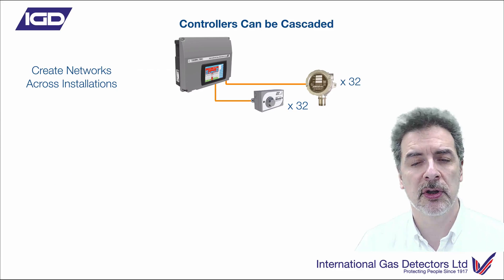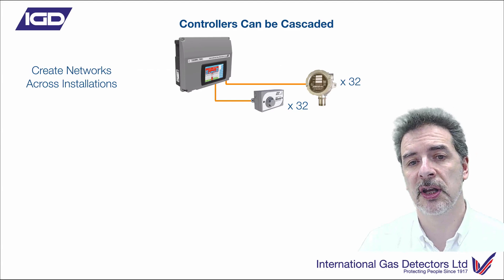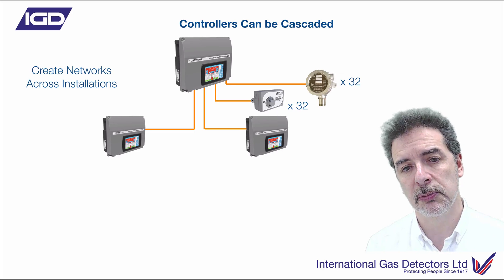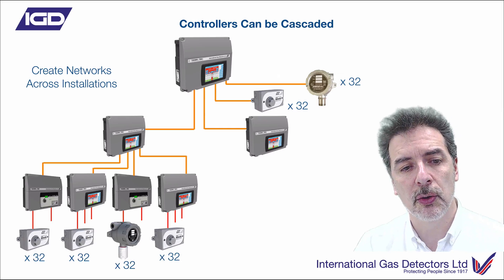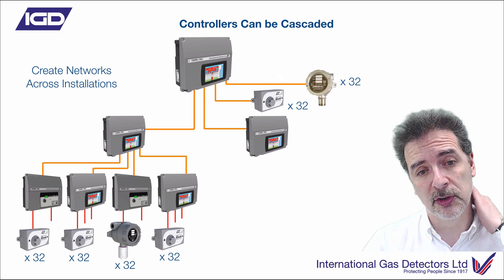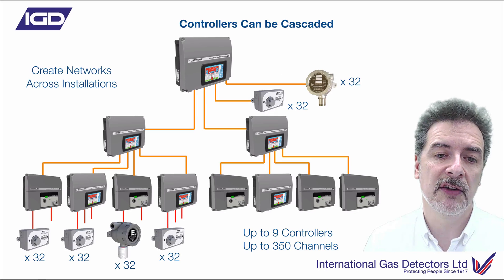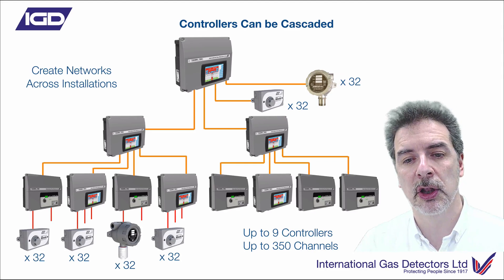Distributing across a network — if you've got a whole host of little process areas, laboratory complexes, or plant rooms — allows you to have some detectors connected to the master panel, then cascade down to either displays with hub cards used to cascade further, or hub cards in field boxes on DIN rail bases out in the field. They don't necessarily have to be complete control panels. You can cascade down underneath those to another four panels, each one with 32 devices on each cable highway, with either two, three, or four ports available, allowing up to 9 controllers and 350 channels. And each one of those channels can also have seven other interfaces connected to it with the I/O possibilities on the detector nodes — giving you a really feature-rich network with lots of I/O capability.